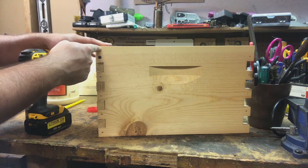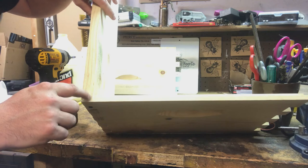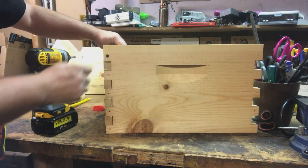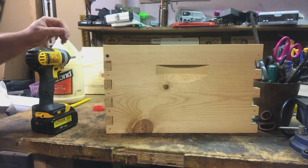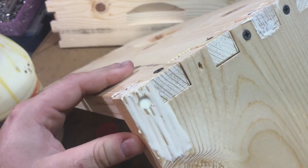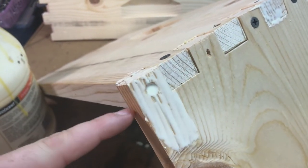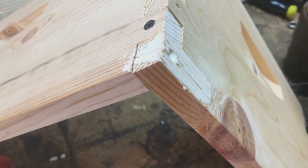Up at the top here there often isn't a hole. But right where this joins it often kind of fails and this lip can come out. A screw right there can fix that, or at least a nail. I would drill a pilot because remember it's rather thin, so drill something before you start knocking nails or screws in there. Well, now I've done it — I split it here at the bottom, but it's not too big a deal. I drove the impact driver a little too hard. The way we're going to repair this is we're going to put some sort of nail or screw in so it goes up here, but make it so the hole can still clear it — that way it will clamp this. We could also clamp it overnight, but I'd rather make it a little bit more secure.